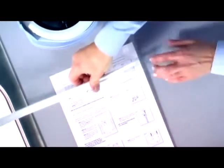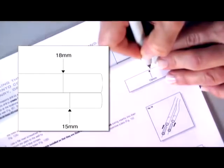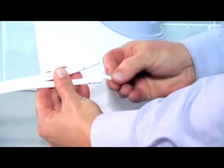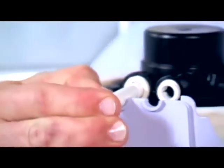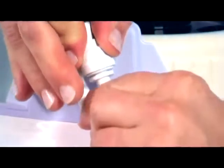You'll need to find the tubing template in the manual. Then lay the large and small tube on the diagram and use a pen to mark a line across each tube at the arrows. Then push the two tubing inserts into their respective tubes. Insert the large and small elbow into their respective locations on the unit — you'll feel resistance, but keep inserting until you meet the line or it's hidden from view. Now simply insert each tube into the proper elbows. Again, you'll feel resistance, but keep inserting until you meet the line or it's hidden from view.